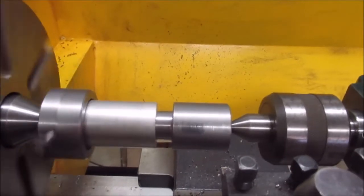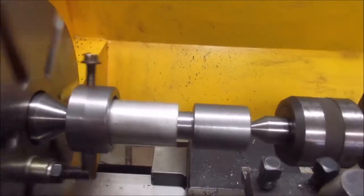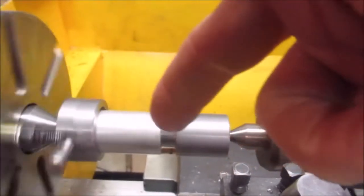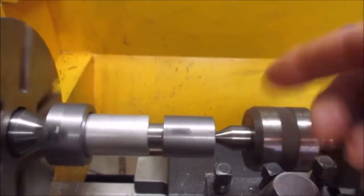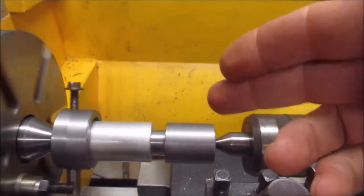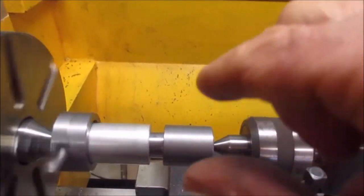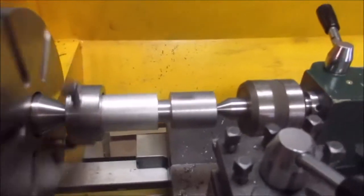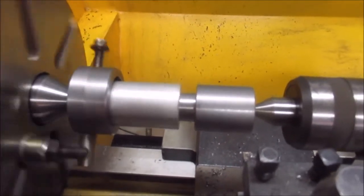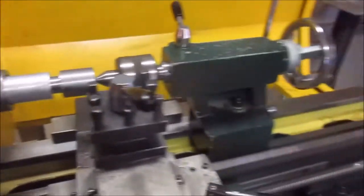It's not that the cutter's going to be spinning that fast, but if I can machine it right the first time, it's not critical since I can move the cutter around. The cutter's always going to be in reference to the MT3 taper center line, no matter what, because the cutter can move. But if this was an arbor for a saw, a slitting saw or something, I'd be off by that wobble, because the blade would be on a diameter, and it would be wobbling. I don't know if you can call it a chuck, an arbor; it's an arbor in a sense. It holds a cutter, tool holder. So I'm going to machine this out of it.